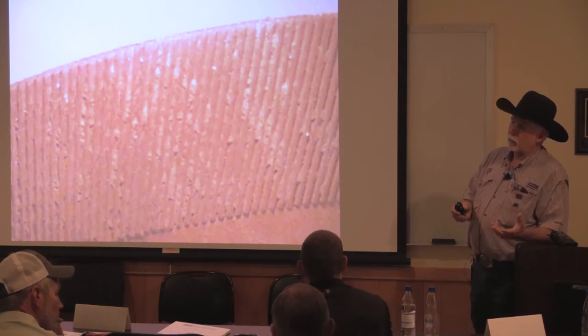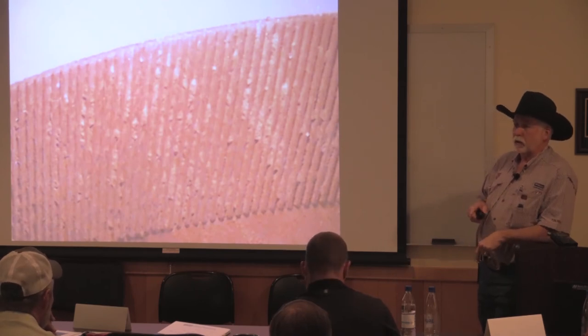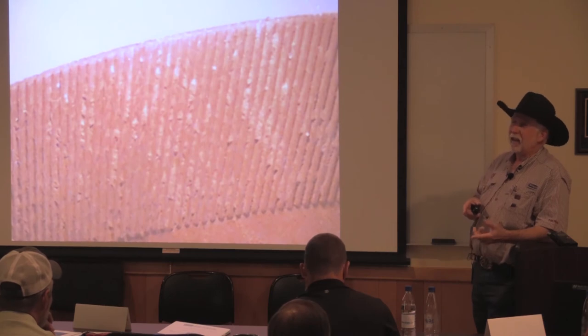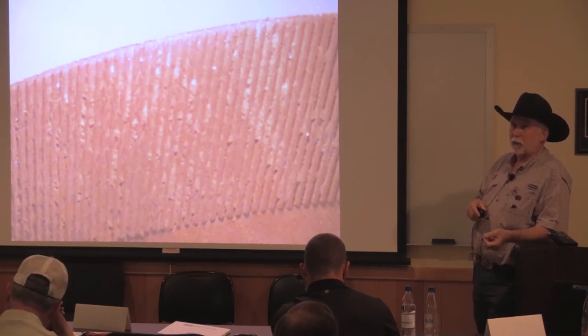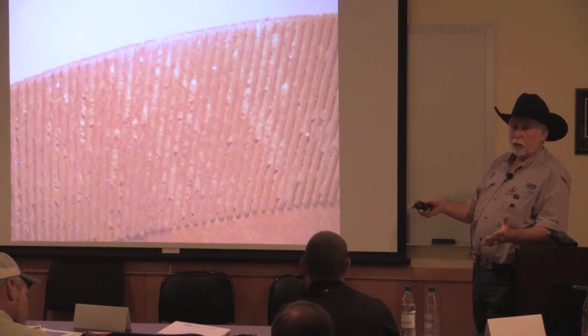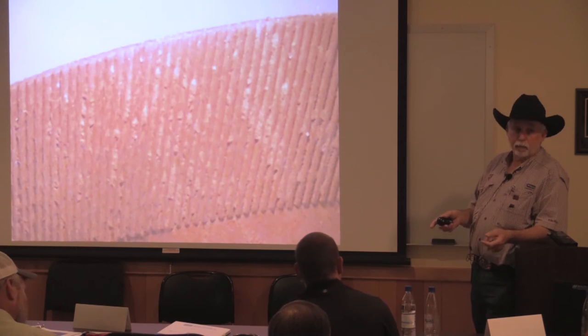Well, they had one of those filters in there when they would flush. Anyway, they took this product and they were injecting it at 2 parts per million. They'd inject it upstream of the tank, and it's not potassium permanganate, I can't remember what the new product is, but they put it in a media tank. But it went from flushing out red to flushing out nothing. It wasn't even stopping it up once they injected this stuff at 2 parts per million.